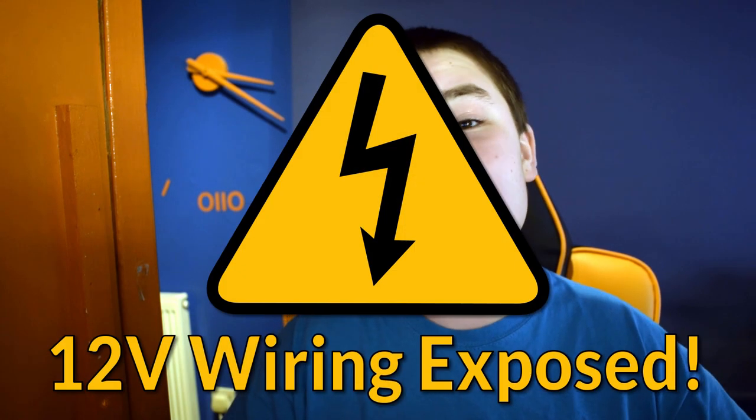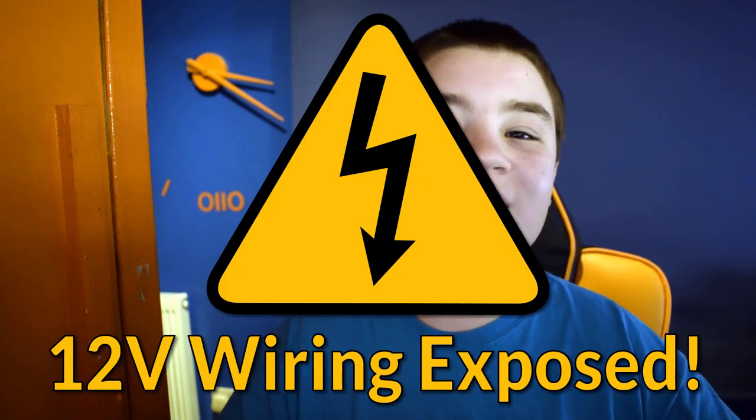If you have already purchased these items and they've arrived, we can now set up everything to make it all work. Firstly, I would highly recommend that you connect your blind motor to the power supply just to check it moves and works as expected. It doesn't matter which way round the wires connect, because all that will do is change the direction of the motor. If it doesn't work first try, just swap the wires over, because it might be that it thinks it's already open or already closed. You need to be careful when you do this though, as 12-volt wires are exposed.